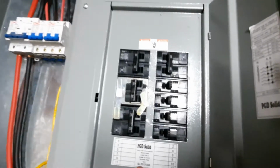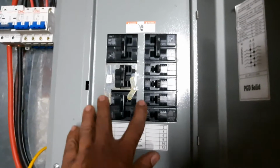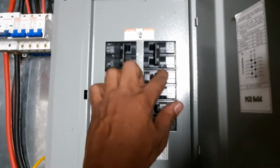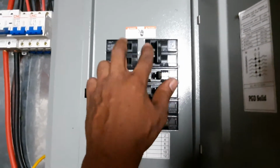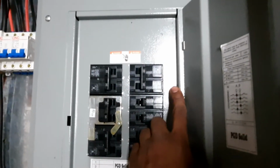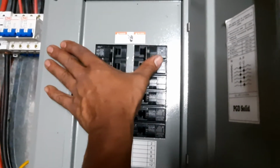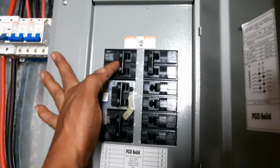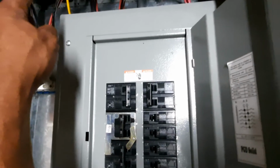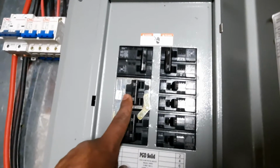And the way I've configured it, this breaker panel is a specially modified breaker panel. What I mean by modified, these sets do not connect to this set of bus bars. I've actually cut the bus bar, the line 1, line 2 bus bar between these two sections here. So what happens is, if I remember correctly, main grid comes in through here. So you turn that on. This one goes out to the inverter, right? And then the inverter comes down and lands right here.